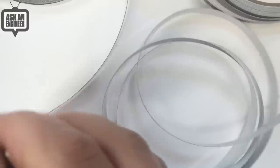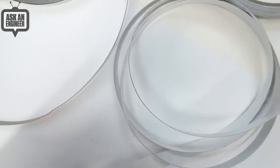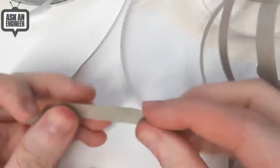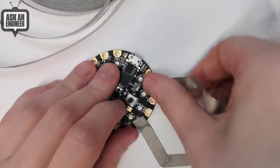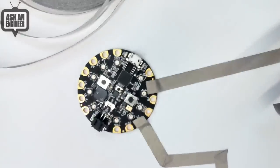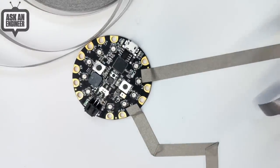We have it in two sizes: five millimeter and eight millimeter. I'll just use the eight millimeter for demo. It's easy to cut, and it has peeling paper on the back. You can really easily cut it — it doesn't tear. Unlike copper tape, it doesn't crack or bend and it's super flexible. It has conductive glue on the back, so you can take your Circuit Playground or something with capacitive touch and just put this over the pad and press down. You can't solder to it — that's the only thing that makes it different than copper tape for most uses. But you can easily bend and move it without worrying about cracking. It's nicer than copper tape, I think.